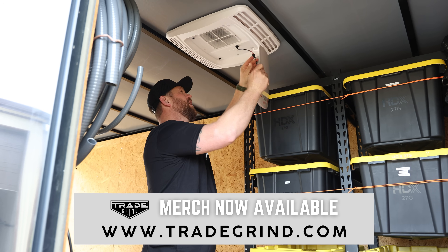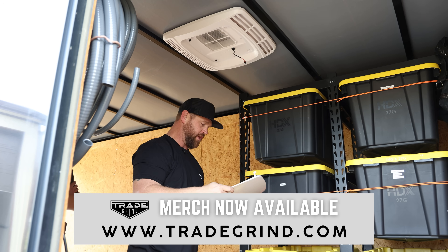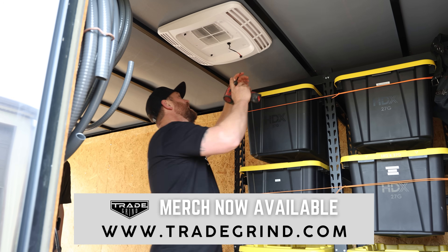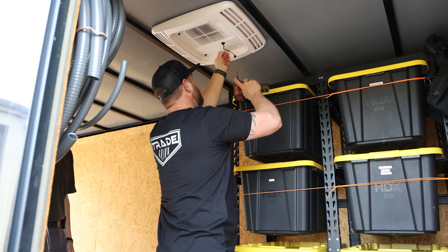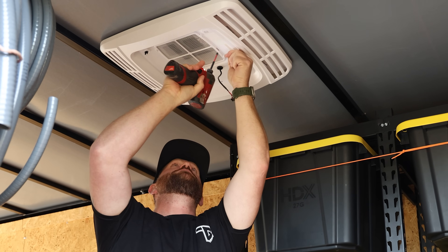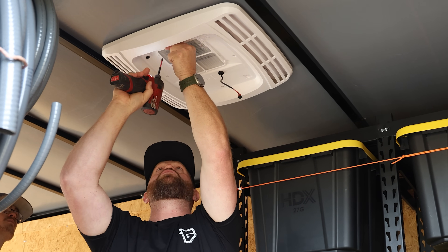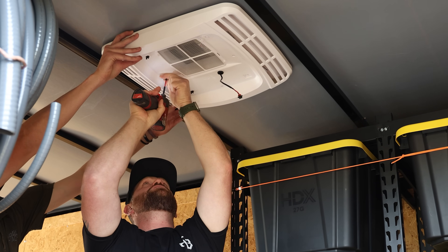This one has worked pretty well. We're getting into the heating season now so we haven't really needed the electric heat, but it's nice to know we're going to have the heat pump version. It's going to draw a lot less power, and being inverter-based the capacity can vary depending on the load. This is like a 14,000 BTU unit — it's not always running at 14,000, so it's going to be able to control and maintain temperature a lot better than this conventional one.